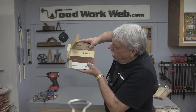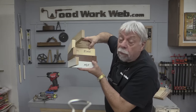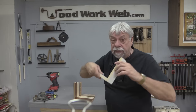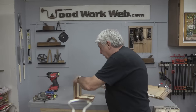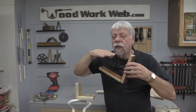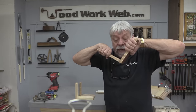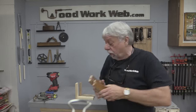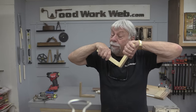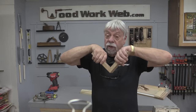I've made a series of pocket holes in different materials: MDF, plywood, pine, and oak, to show how wood selection affects your project. MDF comes apart very easily. Plywood is actually pretty good — for example if you're making kitchen cabinet carcasses it works well, but you need to use multiple pocket holes. Pine is not one of my favorites for pocket holes — it comes apart pretty simply, so you're probably better off moving up to something else. Then there's oak — look at the difference oak makes.